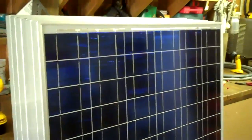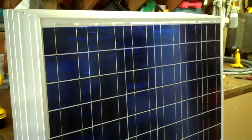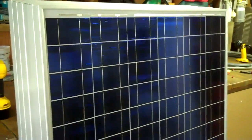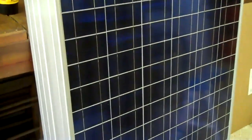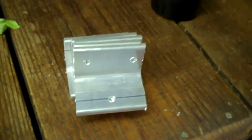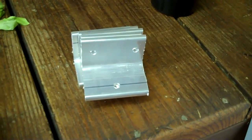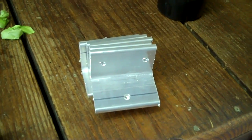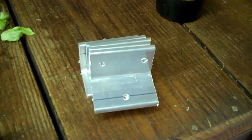These panels are going to be wired in parallel, not series. I think the open circuit voltage on these is like 33 volts, or it might be higher. It was quite a feat to carry these things up there — they're about 47 pounds apiece, and with the wind, that wasn't much fun. The reason I do my own mounting system instead of using Unirac or something like that is mainly because of hurricanes. Their system is only rated like 110, and I wanted to go quite a bit higher than that.